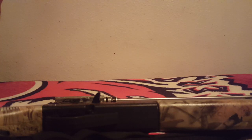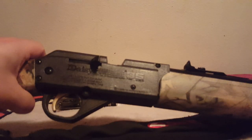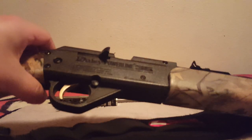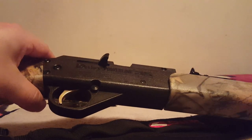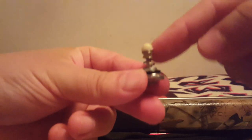Two choices that are right and should do a great job: the Daisy recommendation, 30SAE-ND, and super lube O-ring silicone — the right grade silicone. So again, if you cock your gun, pump it, and air goes out through the barrel, you need to get to your O-rings. If you replace those, lube them, cock the gun, pump it, and it still goes out your barrel, you need to get to your valve and check everything I've talked about.